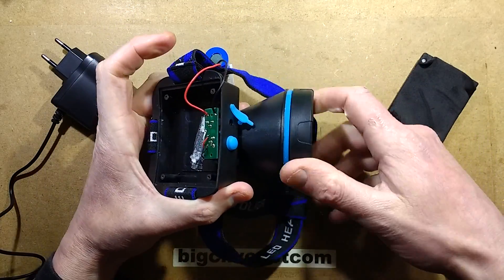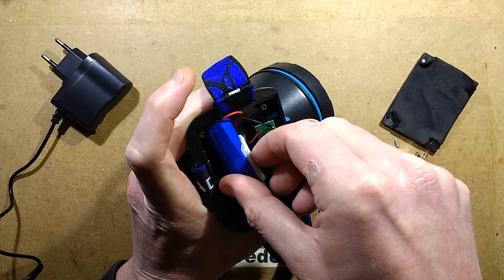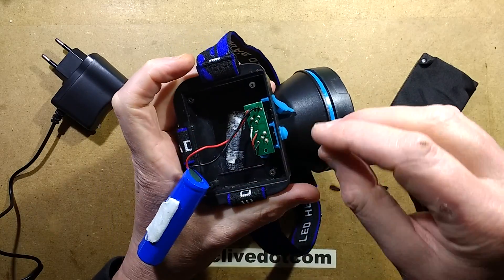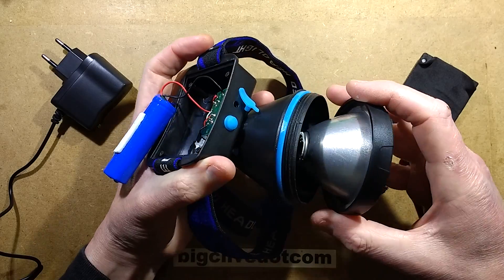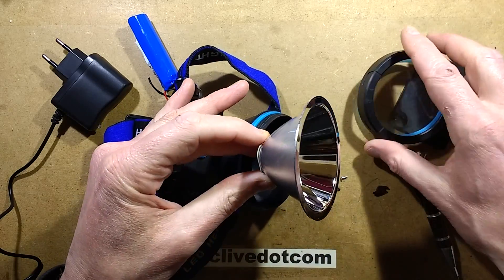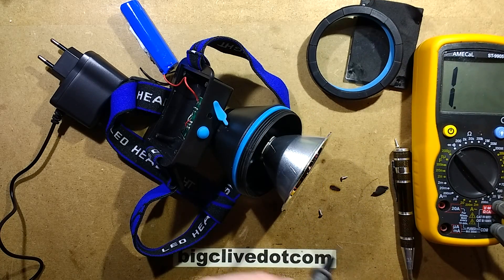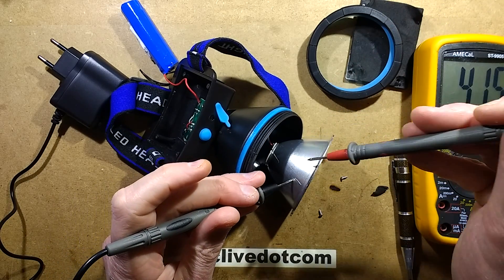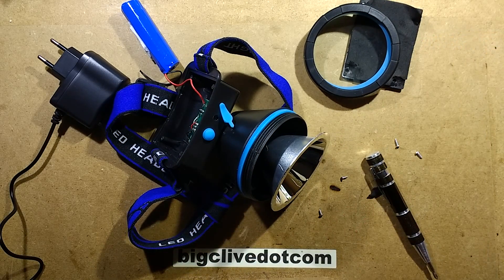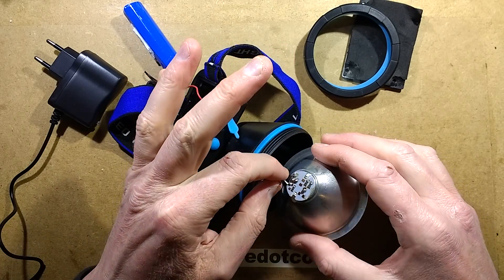Let's pop the head off. It's such a big box here — could they have fitted more in? The battery fits on its own but it's the wires coming off the end. There doesn't appear to be any protection circuitry. This looks like a metal reflector — let's test with continuity. I think this is just an aluminium housing which means it's doubling up as a heatsink. It feels like a pressed aluminium housing, and the LED board has resistors on the back.